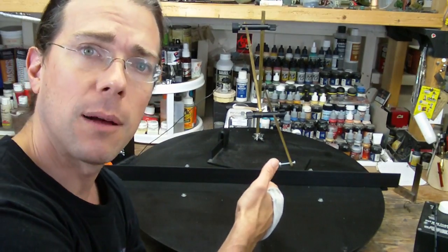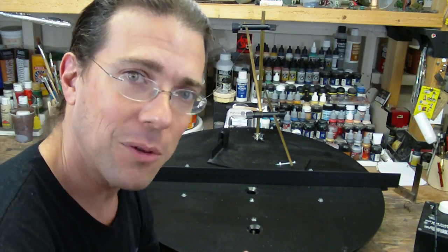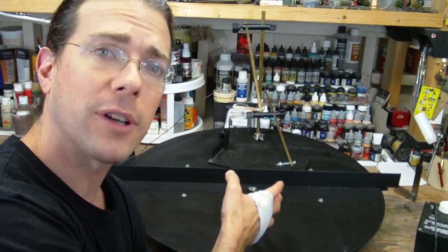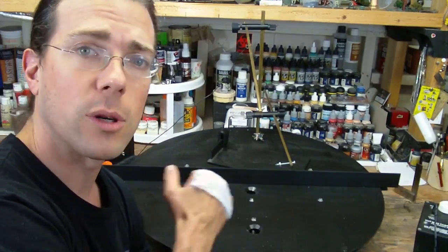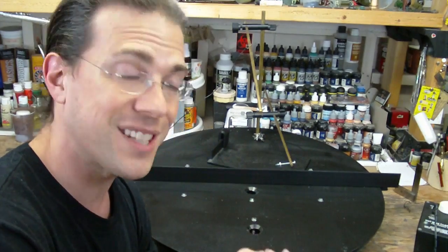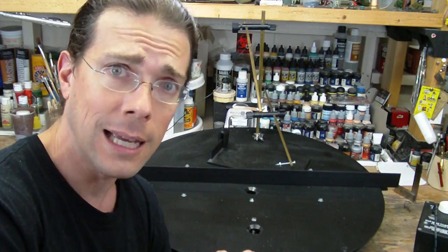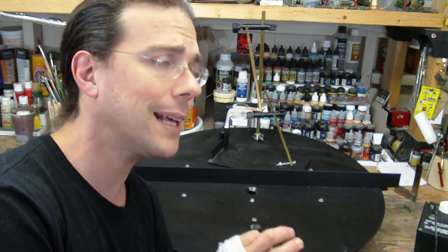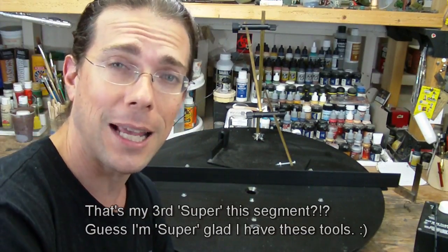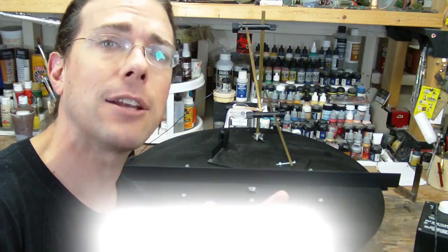The 3D scroll table comes with a variety of wires. There's a ribbon wire, and it also comes with stiff wires that can be bent into shapes, as well as two different gauges of wire to stretch as a taut, guitar-string-type wire cutter. I've been using exclusively the precision wire — a very thin wire. It doesn't get quite as hot so you can't push foam through it as quickly, but it gives an incredibly clean cut. I've been super impressed with its precision, and I've been more than willing to be patient to push through the foam to get that really nice clean edging on the cuts.